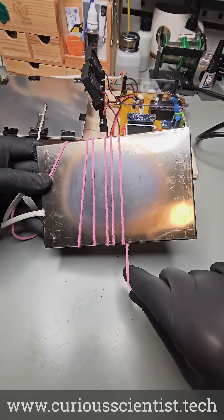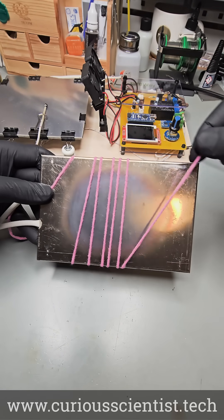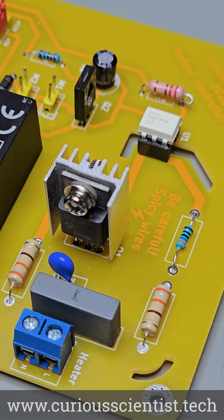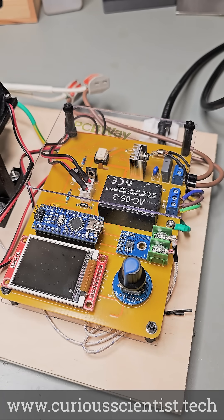Then, this is sandwiched between two Mica sheets to insulate the exposed wires, and it is finally wrapped in a stainless steel cover. To drive the heater, I use a simple triac-based circuit. Since the heater operates at mains voltage, I made sure that the components are carefully separated on the PCB. The triac is driven by an optocoupler to fully separate it from the low voltage part of the circuit. The high voltage side of the circuit is covered by a plexi sheet to avoid accidental contact.